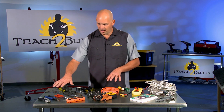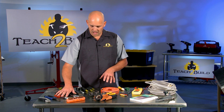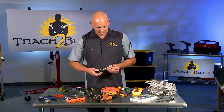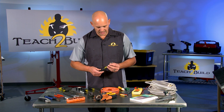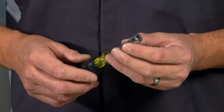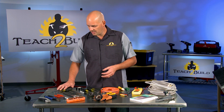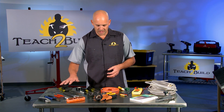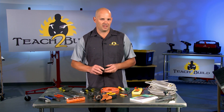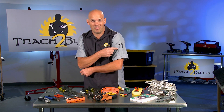For basic hand tools, you've got everything from a razor knife to wire cutters, pliers, channel locks, and needle nose pliers. Nut drivers come in handy when working on ceiling light fixtures and ceiling fans, when something is mounted with a nut instead of a screw. You'll also want screwdrivers of different lengths, both Phillips and standard heads. A Sharpie comes in handy almost every day — I even have a pocket dedicated to one.